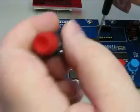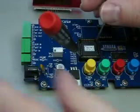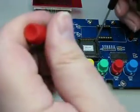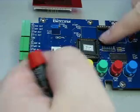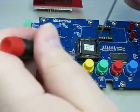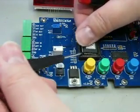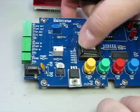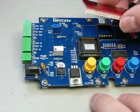Now say you don't have this fancy tool — you can get a couple of little screwdrivers and put them in the slots at the ends like that, and wiggle them a little bit to lift the corner of the chip out. Don't get too crazy or you'll break out the sides of the socket — you don't want to do that. And look at that, she'll lift right out. Then set it back in level again, give it a push, and it's right back in.